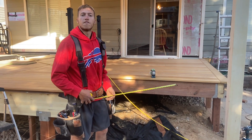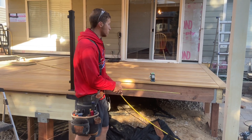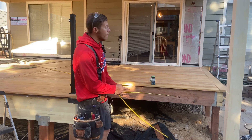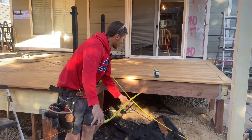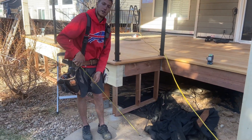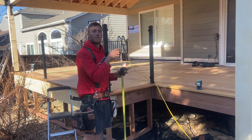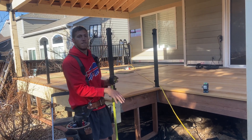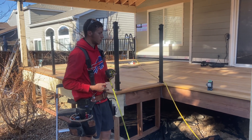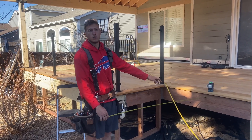Because there's five rises, that means you're going to have four steps, because this last step up doesn't have an actual step built into the stringers, but it's still going to be a rise. We're going to hang our first stringer at those seven inches below there. If I'm going to have four steps, I'm coming out 40 inches, and then I level down from there to figure out where my stairs are landing. So I have a rise of 35 and an eighth, five rises at about seven inches each, and a run of 40 inches — four steps at 10 inches per step.